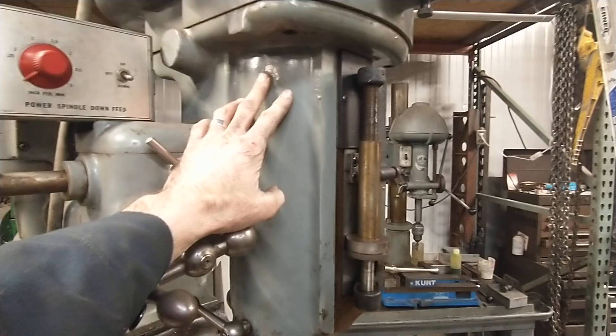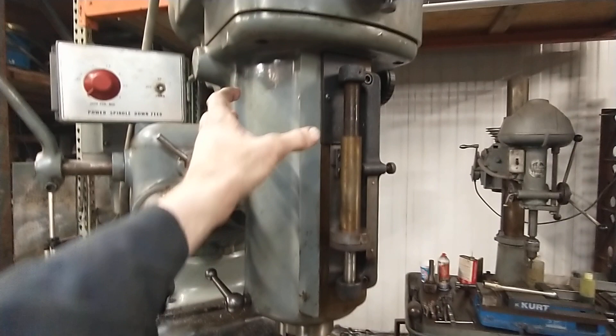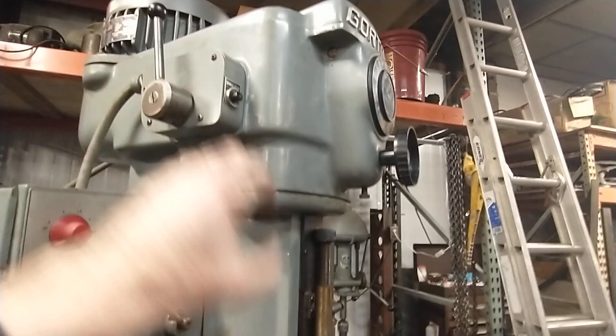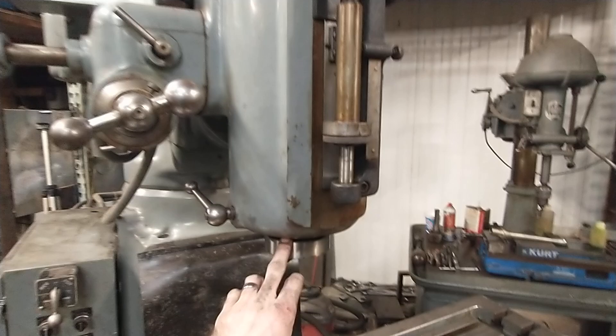Because this machine is from about 1978 and never got used, I've had it apart twice thinking it was gunk, but I've come to the realization that what's most likely happening is the iron casting has normalized over time and warped slightly, pinching the top half of the quill. I think it needs a hardwood mandrel made with lapping compound to lap the top half of the quill housing. It moves perfectly free in the hardened sleeve down at the bottom — I've had the quill out and slid them together with absolutely no problem.